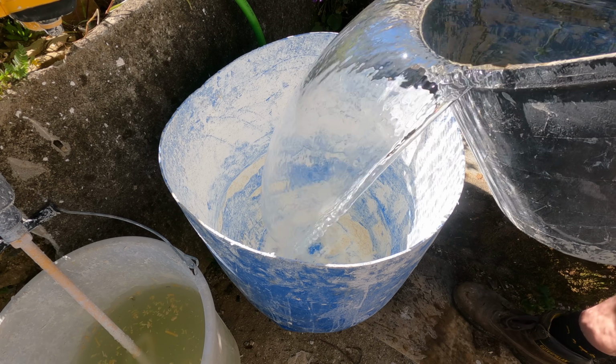And that is 2 buckets of lime, 1 bucket of hemp, and 1 bucket of fine sand. And this creates a really nice, light, almost like soft serve ice cream-like texture, which goes on still quite thick, but it goes on really nicely with a trowel. And so that's what we're going to use today. And I'll mix a bit up and we'll get some on the wall.